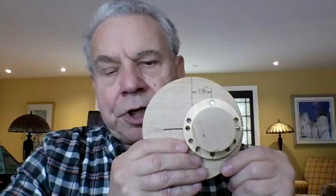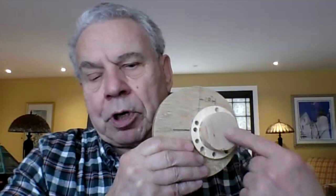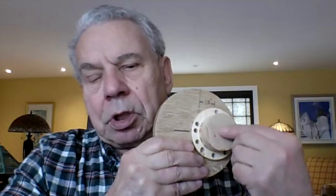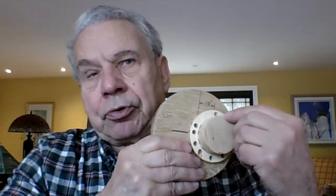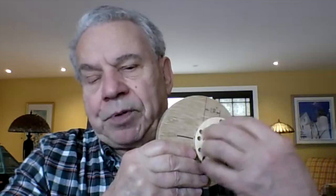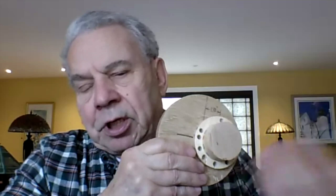Where's the workpiece? Workpiece would be however you want to attach it to this. My preferred choice would be to bore a shallow 2 1/8-inch diameter hole in the bottom of your piece, right where the foot will be, and then hot glue around the surface. So the interlocking of the piece and the 2 1/8-inch hole takes out all of the shear, and so it's just a torsion of turning that the glue has to manage. You could also use newspaper or whatever.